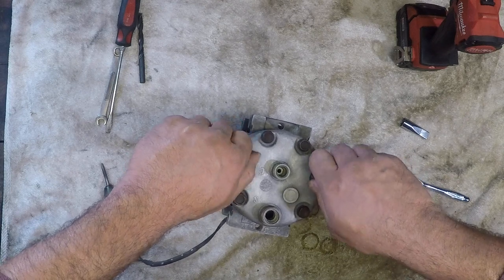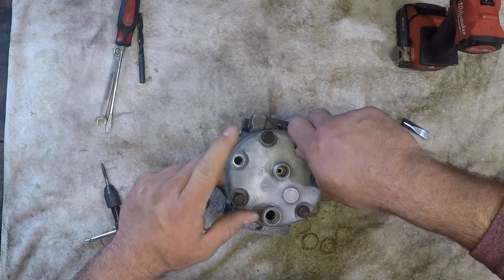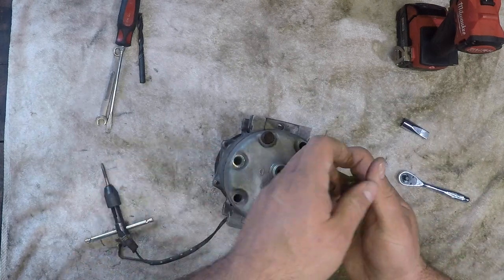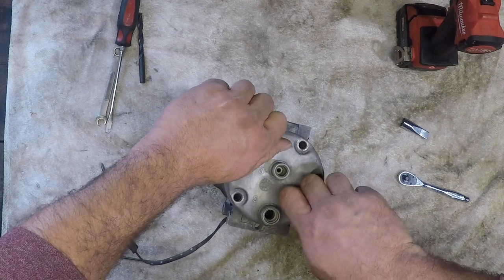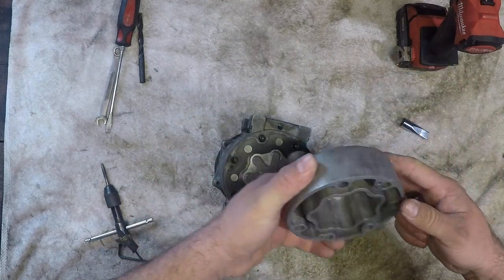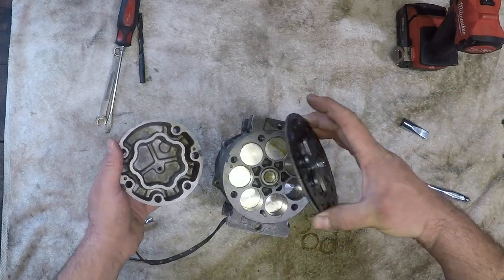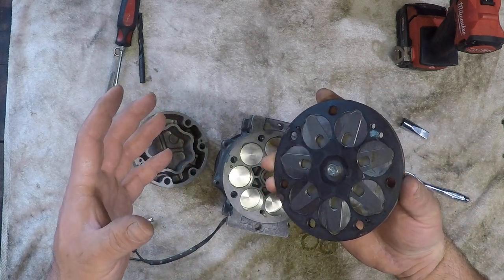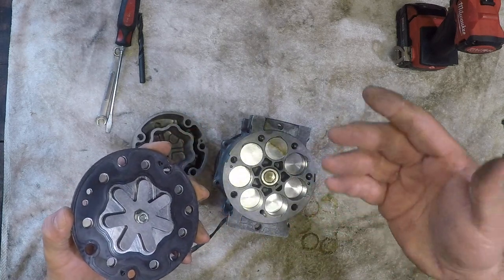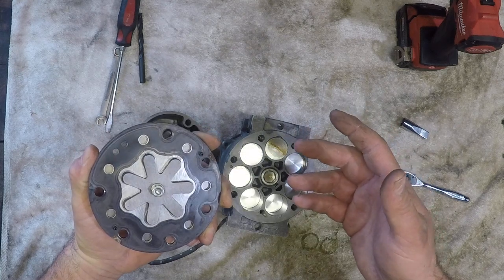When you take these bolts out, what you'll find under here is basically just a check valve and a couple of gaskets. There are only two reasons we're taking this off: mostly to clean the freon out, and to make a small change underneath the head. These compressors are normally lubricated through the oil in the freon. The gaskets — you could change them if you like, it's not going to hurt anything, but if we're just compressing air it's not a big deal if they leak a little bit.